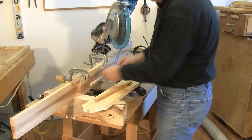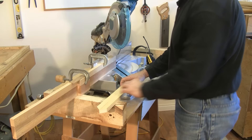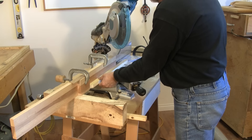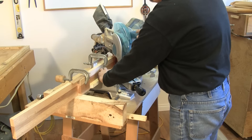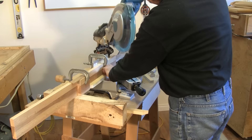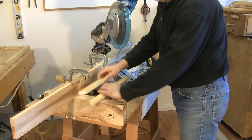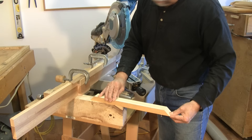I make a marker stick that fits right to that angle, butt it up to the board, clamp it down, and now both of those frame sides are going to be exactly the same length. I'm going to cut my first two sides — this end butts up against the stopper, we make our first cut, second side butts up against the stopper nice and tight. There are two sides of our frame and they are absolutely identical in length.